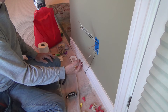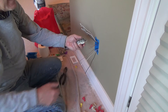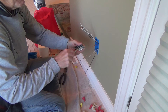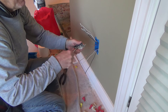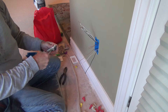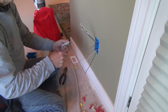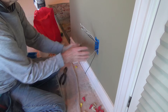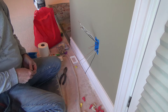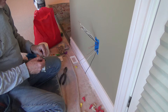This long wire is going to be the one that connects up to the electrical outlet. I'm going to poke everything into the back of the box, and I'll tighten up the side screws to give a little extra wiggle room when pushing it in. Before you work on something like this — especially on a pre-finished wall — make sure your hands are clean. Last thing you want is to get all done and have black fingerprints all over the cover plate.